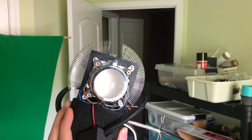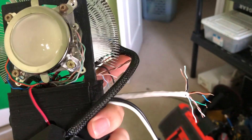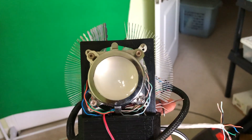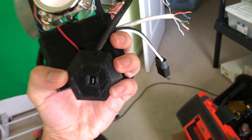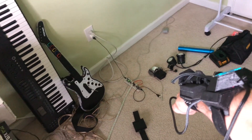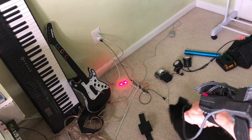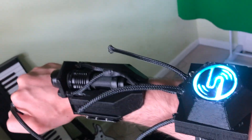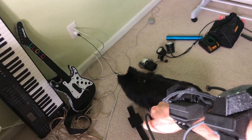That's the complete unit — we have the light, the driver housing, and the infrared receiver. Instead of lighting up an LED it's going to send a five volt signal down one of five wires. The orange, blue, and green wires change the color and brightness of each channel, and the remaining five wires send a five volt pulse depending on which of the five weapons hits it. The flashlight lens focuses the infrared light into a beam so it only triggers when aimed in the right direction — much more directional than a TV remote, so I can point at different lights without hitting multiple at the same time.